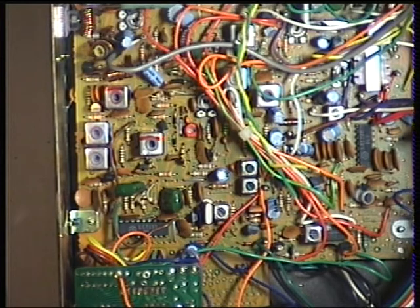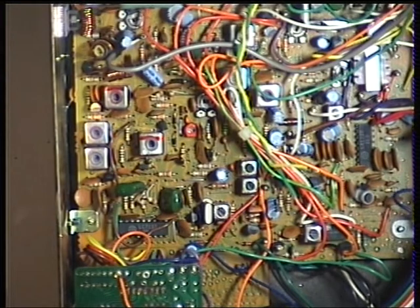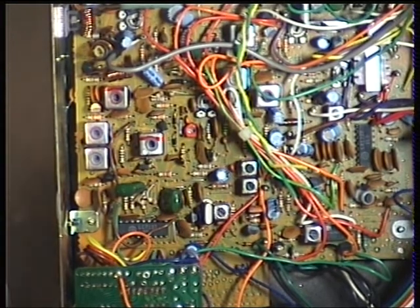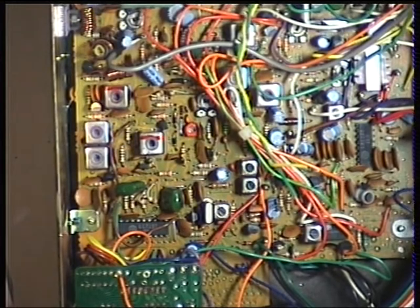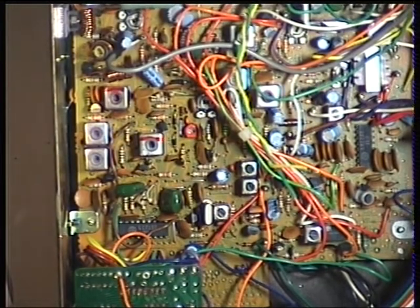0.06 — and then I'm off my clock, that's off the scale now. As I came to this set, do you remember how bad it was? I said it was like one microvolt. I'll switch to one microvolt — and that's quite a solid signal. So we've brought all that gain back, all lost by being screwdrivered by some wally. That's now restored the receive to perfect working order — these are very sensitive sets.